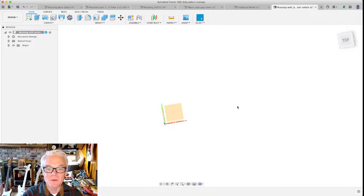And that, I think, is really the most important thing you can say about a guitar when you're building one: what is the scale. On the guitar that I want to build, I've chosen a scale of 24 inches, so 24 inches from the bridge to the nut. That means the 12th fret, which is in the middle of the scale, is going to be at half of that distance, which is 12 inches. So I'm going to make two.